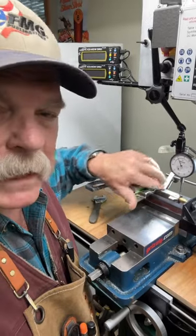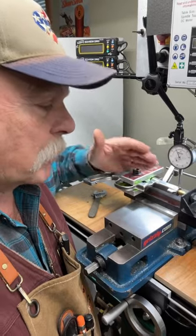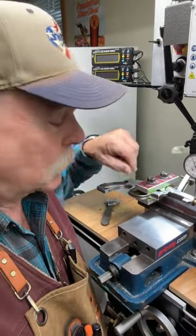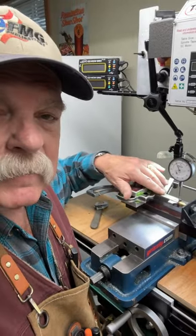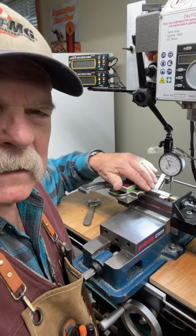I'm doing a groove in this rather than a slab. If it was a slab, this would be set upright and you'd be running a mill sideways down the side of it. I'll do a short video of this once it's finished, or maybe one with it in progress.